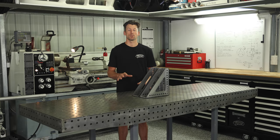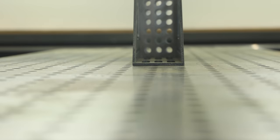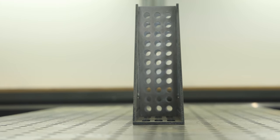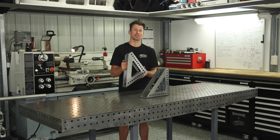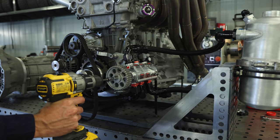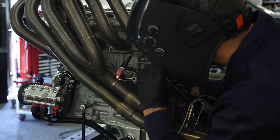This fabrication table is one of the best things in my garage and you can download the plans and DXF files at engineeredtoslide.com and fabricate one yourself. It's made from six millimeter thick mild steel that's pickled and oiled, and it has 50 millimeter center holes with a 16 millimeter diameter stretching all over the 2400 by 800 millimeter wide surface. This allows us to mount angle plates such as 90 degree angle plates and riser blocks to jig parts so we can weld them without them warping. By downloading the plans and getting these flat packed and ready to weld up, you can save a whole heap of money.